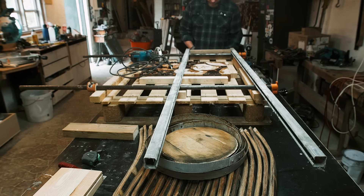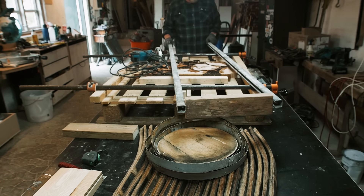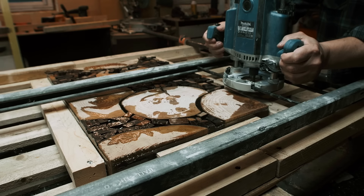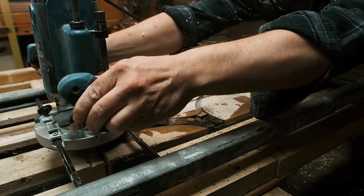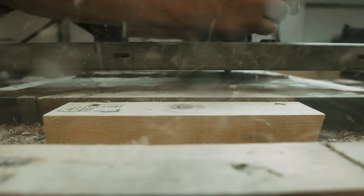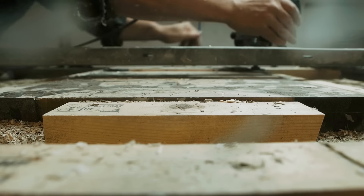I have two long metal things from some sliding barn doors. I had a lightbulb moment a year back — some would say that was the only one — where I figured out that my router came with these metal things that fitted magically in the sliding barn door slots. This allows the router to ride very close to the surface of the subject in need of flattening. I flattened both sides this way, while dreaming of getting a really big thicknesser, or at least a friend who has one.